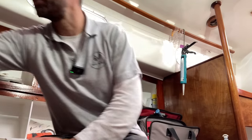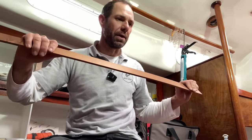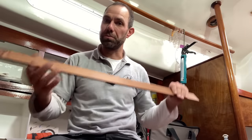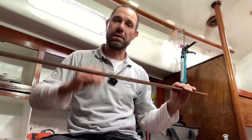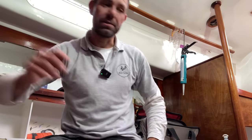It's going to be quite tricky because I've got to flex that piece as it goes in. I'm going to make it slightly oversized and flex it into place. It should bend because this TMT material is flexible to some extent, so it will take the curve. But obviously when you've got multiple pieces all glued together with a fibreglass backing it's going to be slightly stiffer. I think that's the best way of doing it and maintaining a nice flat surface when gluing onto a surface that isn't flat.